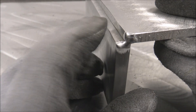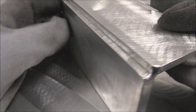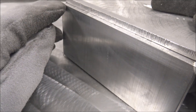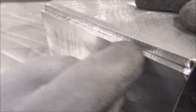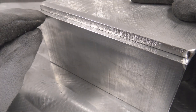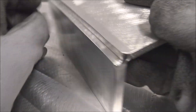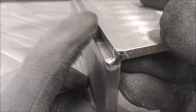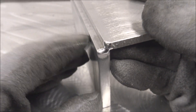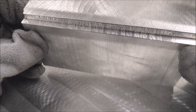This is about as thick as you can go for a single pass - you'd have a hard time getting full penetration and a nice crowned-over smooth weld. Unless it was three-eighths and three-eighths, I'd probably run one single pass down in the root and then either a fat one on top or two stringers, maybe a fat one with just a little bit of weave if you needed it. But I think I can get away with a single pass here, and I'll show you later in the video exactly what he's using this for.